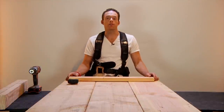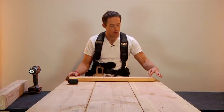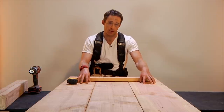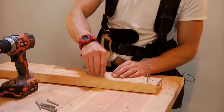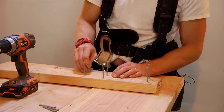This is not fine art, and you can be as methodical with this as you want to. I put in pilot holes so that I'm going to eventually have 4 screws in each of my 2x12s — 4 pilot holes here, 4 here, and 4 here. That way I can really affix this down onto each of the 3 tabletop pieces. The more work you do with wood, the more special tools and tricks you'll come up with apropos for your own personal style.